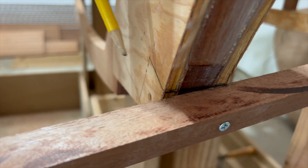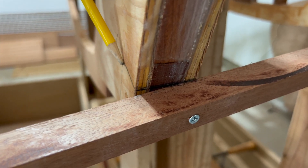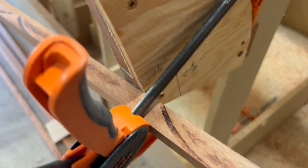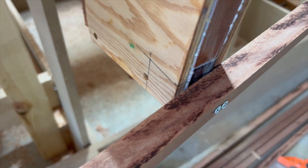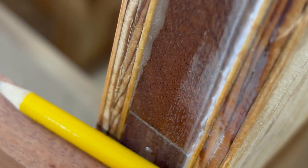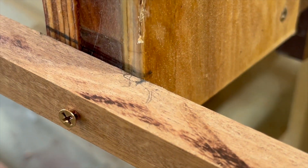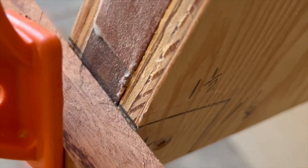On the front side I measured an inch and a half from this edge in, so it's not going to go quite as deep because it's going to follow the contour of the batten. The same thing is true on frame 12, and I follow that through on frame 11. Because the batten is out, to keep that shape I just don't have to cut as deep into the front as I do on the back. On frame 10 I can see how it's going to line up, and on frame 9 which is at an angle, I'll mark and cut those separately.